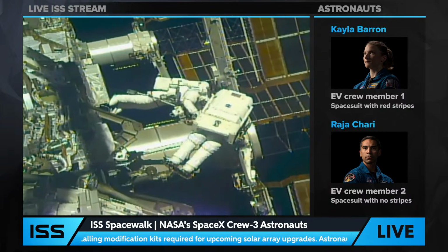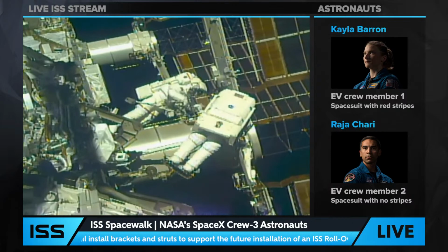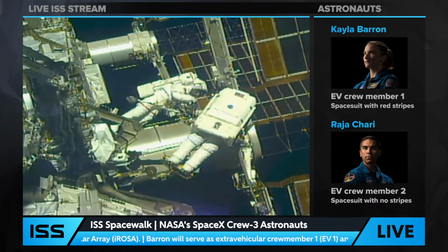And again, friendly neighborhood Fairchild fasteners here, so use caution, and you can hand start bolts M1 through M4 two turns. I'm going to plan to use my PGT for these ones. Copy that. PGT, it's the long PGT for M1 through M4. And then, Raja, over to you two on the sequence. Can I get settings for that? Affirm. Alpha 2, clock 2, and we just go with the side pad first, and then we'll come back to Raja. So alpha 2, clock 2 for M1 through M4, two turns each.